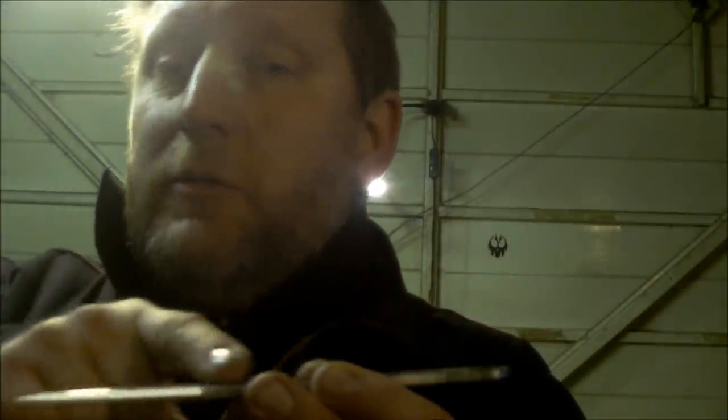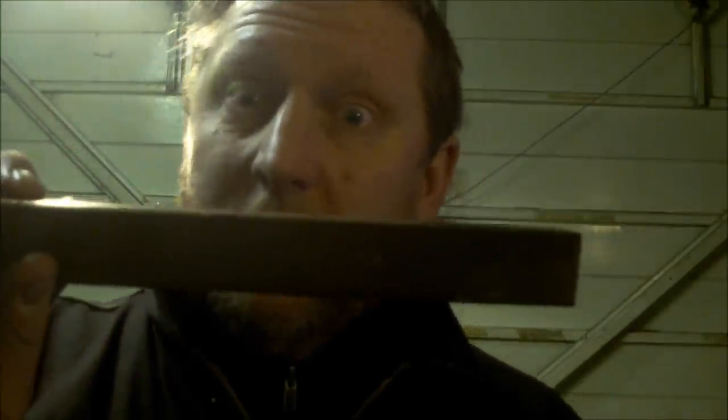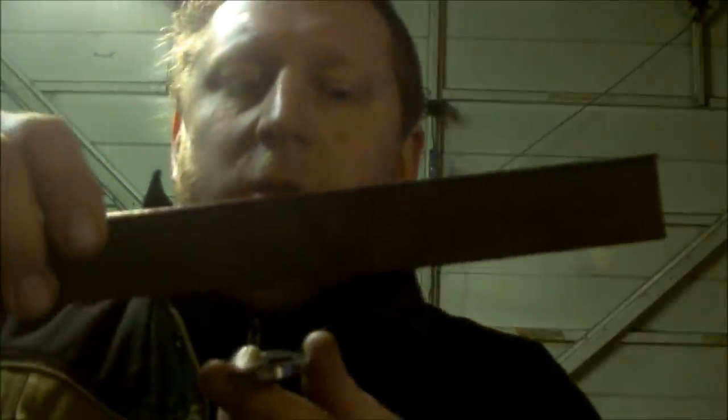You go past the section, but there's no point finishing up there because you want it coarse and gritty with a lot of key for the glue when gluing the scales on. You're going over the tip but not rounding it off because you'll upset your bevel. Going backwards and forwards as flat as you can — there's a lot of movements where you can go diagonally to blur and even out the grain pattern. I like to go backwards and forwards, and you want it flat — you can use a piece of hardwood with abrasive underneath.